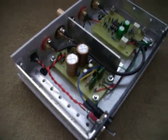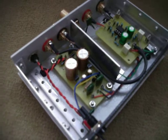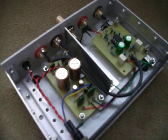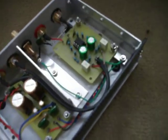The other two active components are a 79L15 and 78L15, which are 100mA regulators. They're actually quite good low noise regs, so ideal for this. I've wired it up nicely — all the wires are twisted together so I'm not picking up any hum.